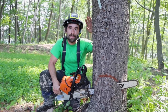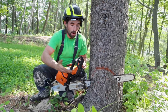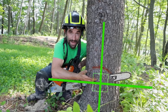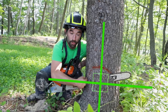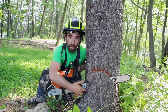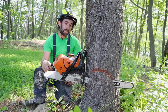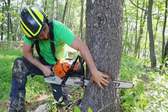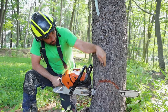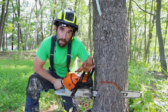Right here is where a lot of people start to go wrong. You can see my saw is at quite a bit of an angle — my tip hasn't come down so that my bar is perpendicular to the grain of the tree. I want a nice 90-degree corner between my chain and the tree. With a dull chain, the tip of your saw isn't going to cut as fast as the part with pressure on it. I need my saw to be right around here so that my face cut is 90 degrees to the axis of the tree.